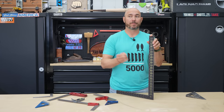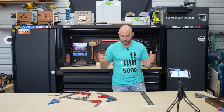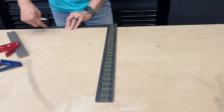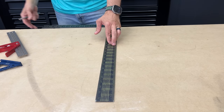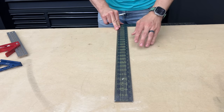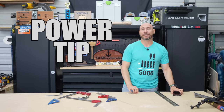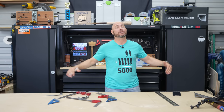When you're looking at framing squares, don't go cheap — pick a name brand like Stanley or Empire. When you get the framing square in the shop, the first thing you do is find a square edge like a piece of plywood or your tabletop. Butt that up against it and scribe a mark with your pencil along the long edge. Then simply flip the square over and do the same thing — line up that mark and scribe again. That should be the same line. If it's not, your square is not square — take it back and get another one. That's a power tip: you can check any square in your shop this way, so long as that leading edge is straight.